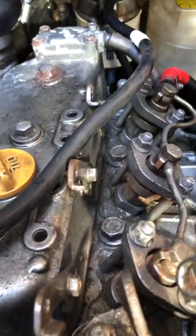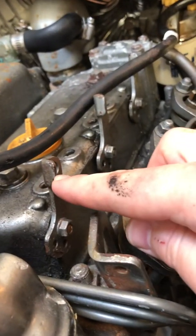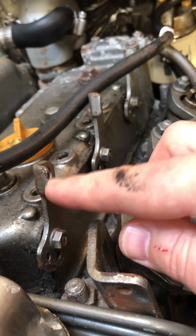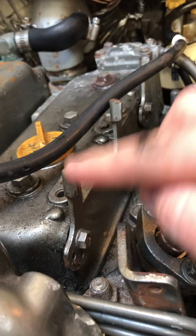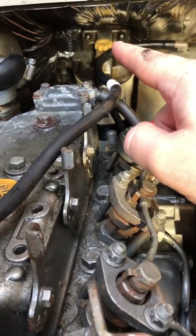After I got the high pressure pump bled out, I started the engine. Something I did prior to that — I don't know if it worked or not — but these are my decompression levers. You open these up and the cylinders don't get compression, so whenever you start it you won't hear it trying to turn over hard — it sounds like a sewing machine, just click click click click. You do that to cycle fuel through the lines without trying to turn the engine over under full compression. I did this three different times, but it didn't work for me. I could not get it to bleed that way. But that primary pump did the work.